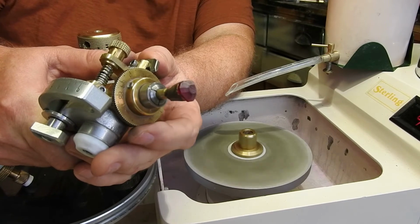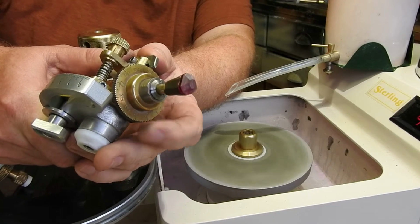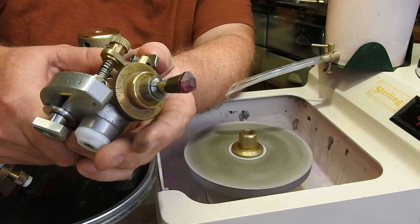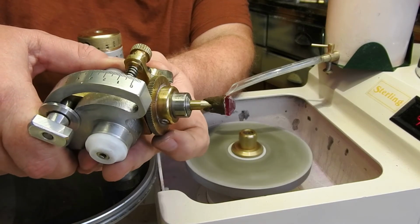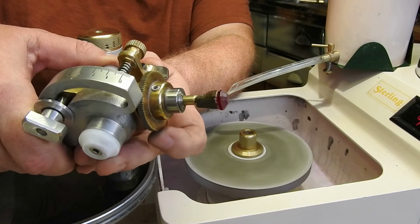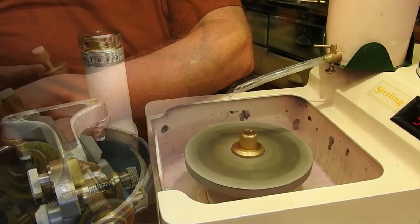the crown. And what I'm going to do now is, as opposed to use the 100 disc, go down to the 260, which is less harsh, and just get it a bit closer to the girdle, because the girdle, as you can see, is very thick at the moment. But I didn't want anything to chip, so we're taking it steady from here on.